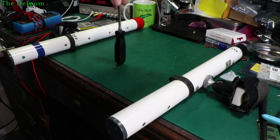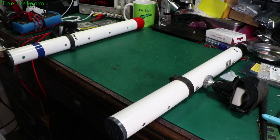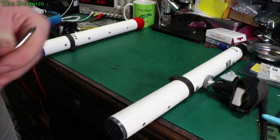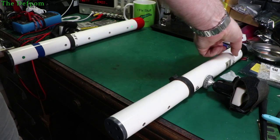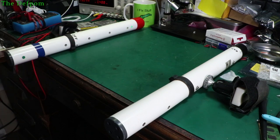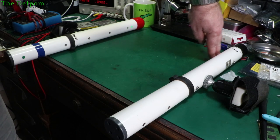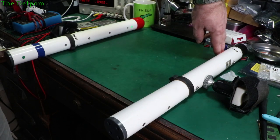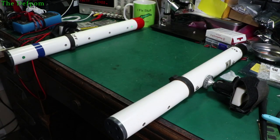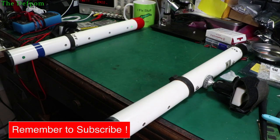It gets like cross beams as well. Anyway, it's working. I guess I don't have to replace the LEDs after all. And that's with my lights on as well now - before that wouldn't work, I'd cover it up and nothing would happen. Now it is actually working. I think there must be some refraction through both these lenses. I'm going to block both of these top LEDs because it does seem to be affecting it. It's fine - just needed a clean. Hope you found it interesting, catch you later.